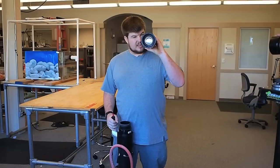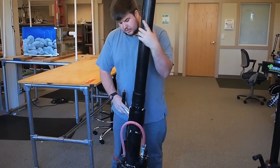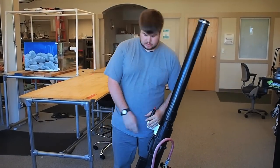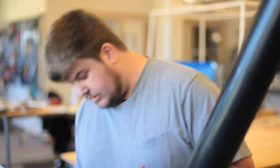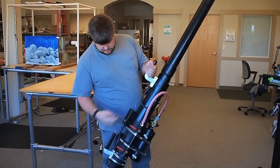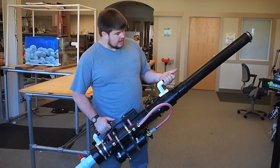The cannon's been loaded. Screw the barrel back on. Another option for adding the barrel is you can get what's called cam lock connectors — it makes it a lot easier and faster than unscrewing and screwing the barrel. Then to fire, once it's been charged, I have two piezoelectric igniters and there are electrodes on the inside of the chamber. You just squeeze both and the air-fuel mixture will ignite and the projectile will fly out the barrel.